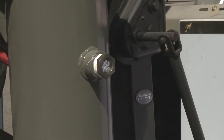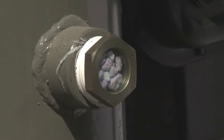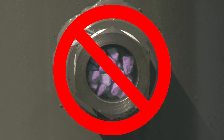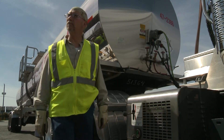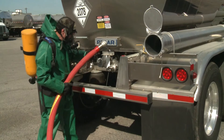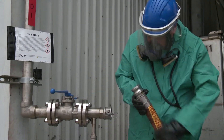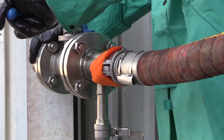If the tractor's compressor is used to generate air pressure, it is extremely important to check the sight glass on the air dryer for signs of moisture. If a color-indicating type of dryer is used, the pellets will be blue. If there's moisture in the sight glass or if the pellets are pink, contact your supplier for assistance. If the tractor's air compressor is used, the driver will start the compressor and maintain suitable pressure at the unloading operator's direction. The driver will make connections to the tank truck and operate tank truck valves and all other tank truck equipment. The unloading operator is responsible for connecting the unloading hose to the receiving line and operating the valves in the receiving system.